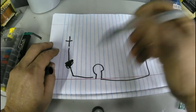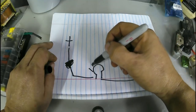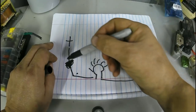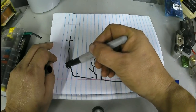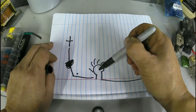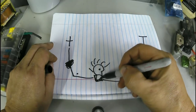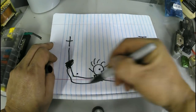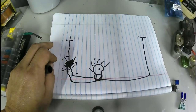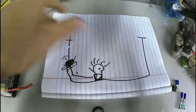Come down and in. The reason the fuse is there, if this light pulls too much power, this wire gets hot. Well, the fuse will actually blow, stopping the power going from here. Let's say something gets shorted in the socket that's here. That will blow the fuse. It'll go pow. Won't work. No more. I know. Crude design, crude drawings, but hey, I'm not an artist, am I?